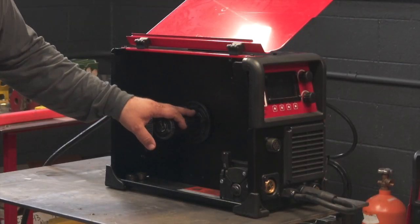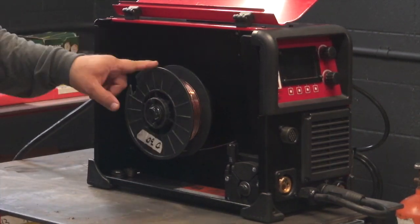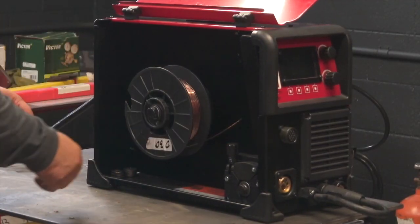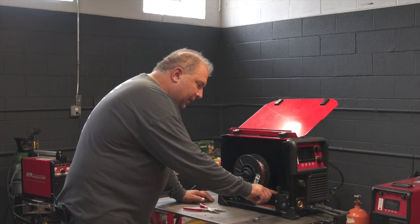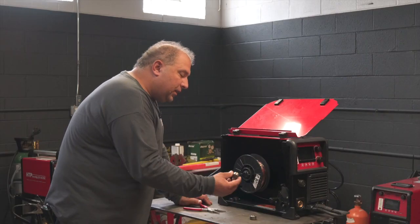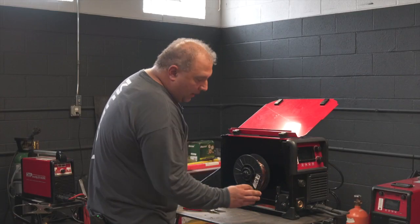Alright, this one here shows how to install the wire. It covers the topics of the wire feeder, how to put the wire spool in, what the spacer is for, and how to set the spindle brake tension. The brake tension changes between steel and aluminum wire, so there are a lot of little things that people sometimes don't catch on to — they've been MIG welding for 20 years but never really adjusted any of this, and never really fed aluminum wire through their machine either. So there you see the drive rolls lined up, everything explained and laid out.